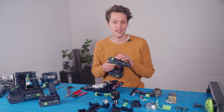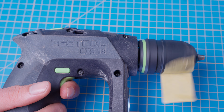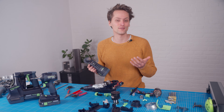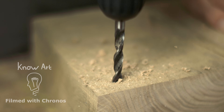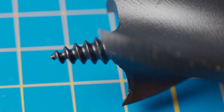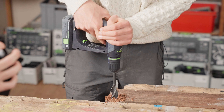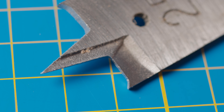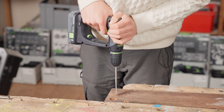Regular drills have different gears to go fast with a little bit of power or slow with that oomph. This makes them great for all the things that require different speeds and different amounts of torque. For drilling small holes in wood you want high speeds, but with a big auger bit you mostly need a lot of power — too much for a small drill. Funnily enough a regular spade bit needs mostly speed again and it could do that perfectly fine even in Azobe wood.